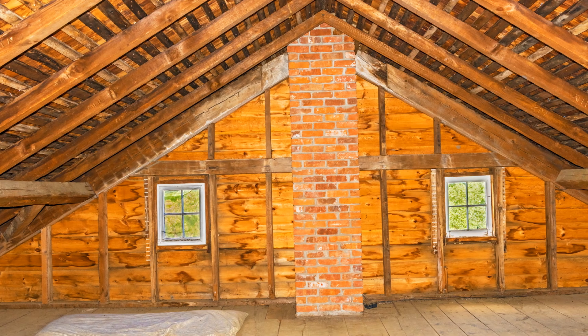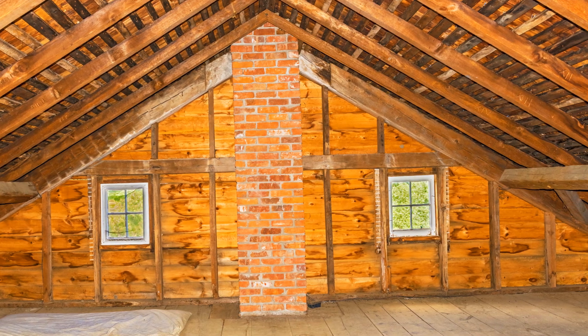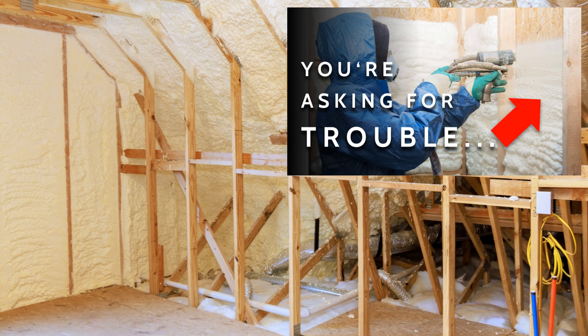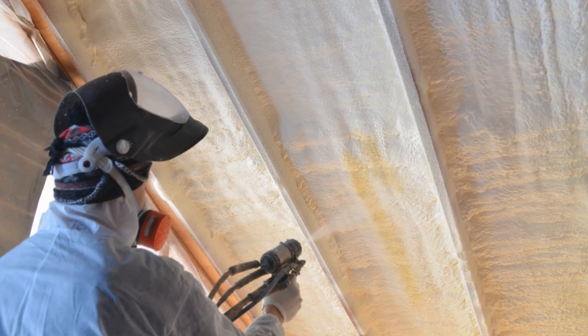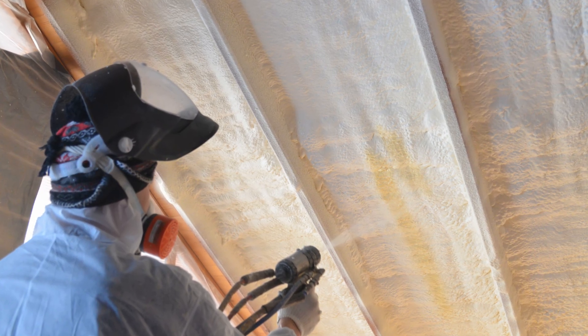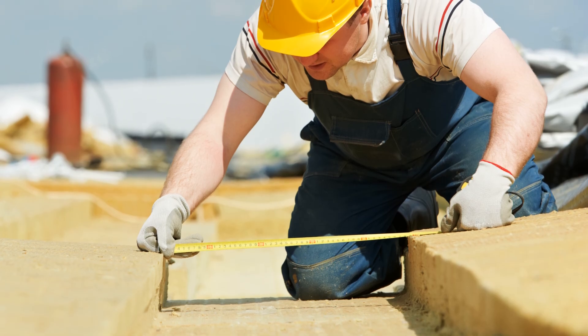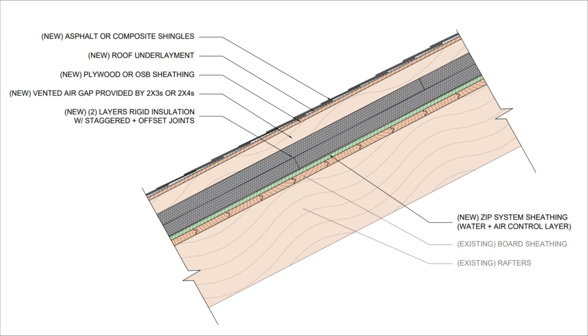You have several options here. As you alluded to, adding exterior rigid insulation is probably going to be the best thing for that roof assembly. I would not recommend spray foam — I've had a lot of issues with it, including off-gassing and cracking, which impacts how well it air seals. I would recommend waiting until you can install rigid insulation. For a new roof assembly integrating rigid insulation, I would install a new layer of sheathing, then apply a self-adhered vapor-permeable membrane, or use Huber Zip sheathing with taped joints to serve as air barrier and water control layer at that layer.